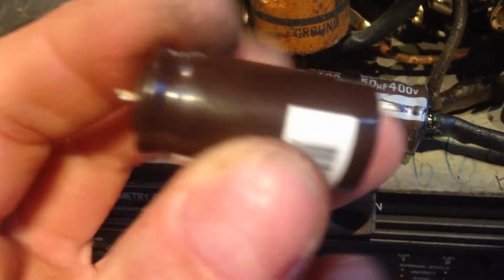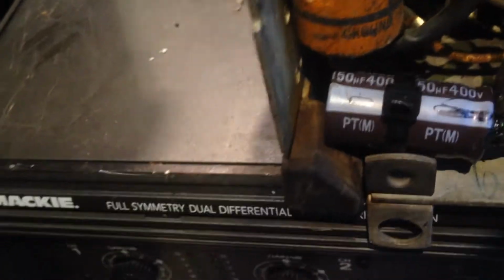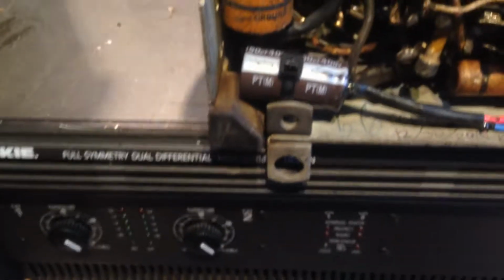Anyway, so on the Philco, you heard the buzz before. It had a lot of filter hum. So here's what we did. I took this just like this from the power supply, really high quality Nichicons, a 50 at 400 volt, and did some liquid electrical tape. I got this wiring kit from the Chinese tool store. This wiring is a good 105C insulation.